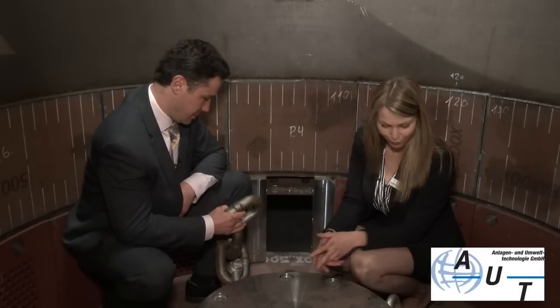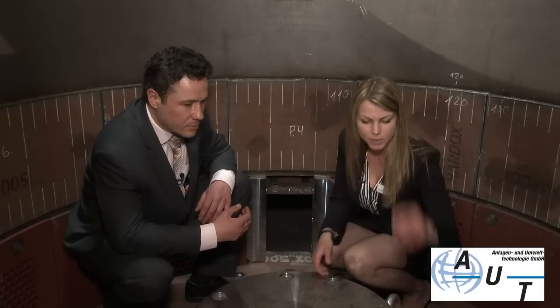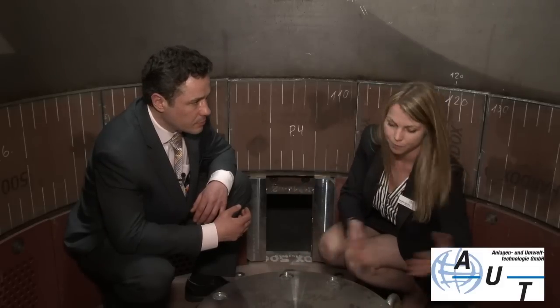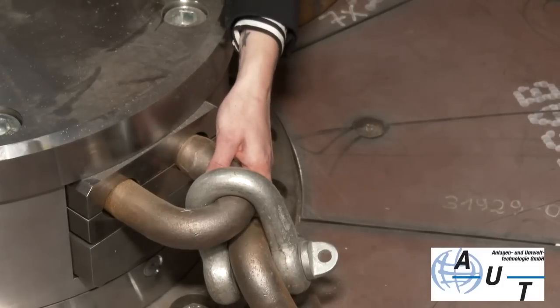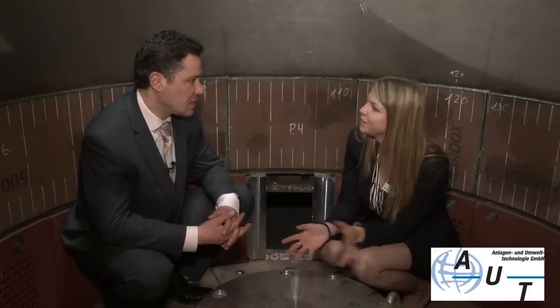So here are the flails. Can you tell us some more about them, Maureen? They're actually pretty heavy, specifically in this machine. It comes in two or four — two sets of chains or one set of chains, depending on what the customer wants to use. This element here is essentially fixed — it's clamped into the chain head, so you can remove the head and take it out. But typically the customer tends to change just the end pieces of the chain and exchange them with new ones. And how long do these chains typically last? It really depends on the input material. If you have metal scrap in a three-shift operation, you need to check at least once a day what the chains look like, and then you can put in new ones or turn them around, depending on what they look like.